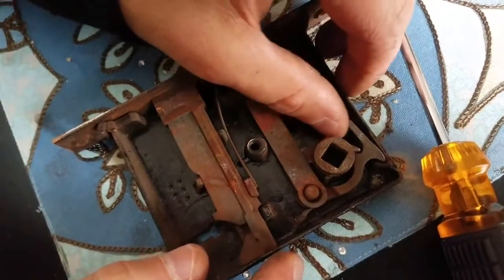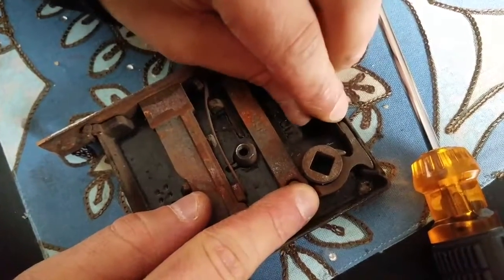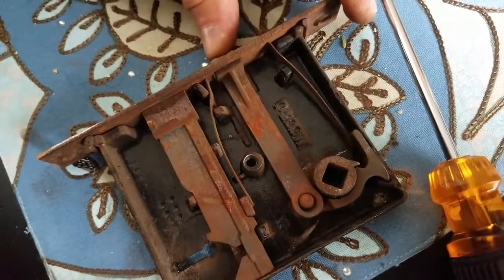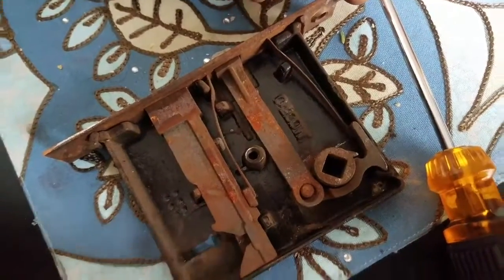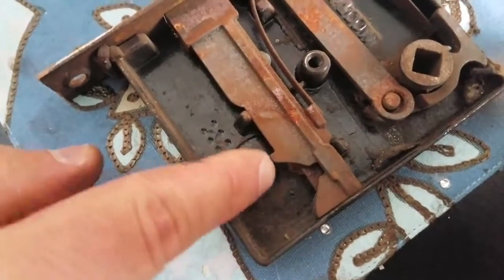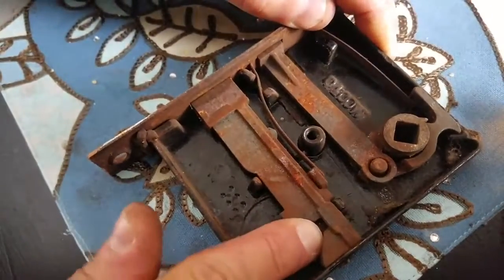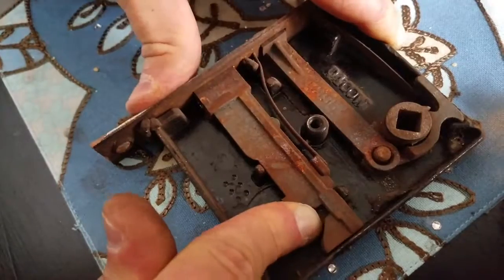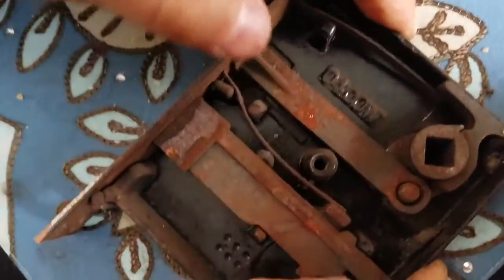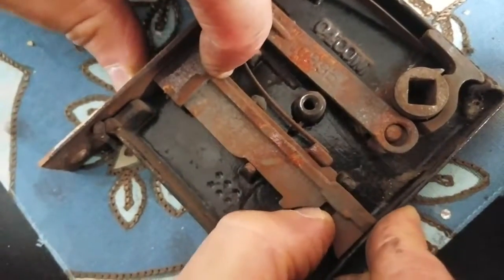All I had to do is set it up like this, then take this piece of metal and just put it right here. And then it articulates the spring. Unfortunately I don't have the skeleton key for this door, but I'm going to hunt one down. Pretty much you put your key in, then you turn it, and then you press this mechanism up, which then pushes this up, and then you're able to slide — see how it moves it up? Then you'll be able to slide your locking mechanism out, and ultimately lock the door.